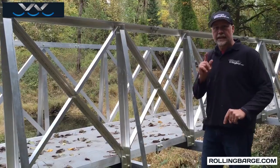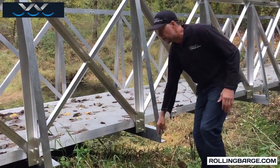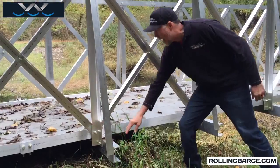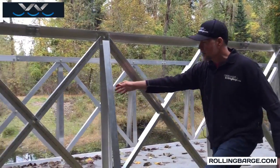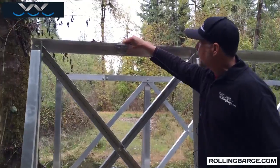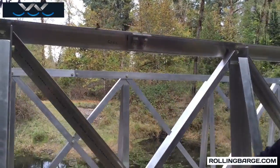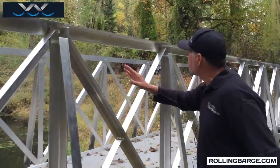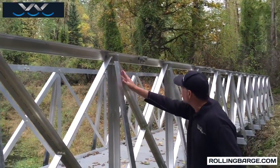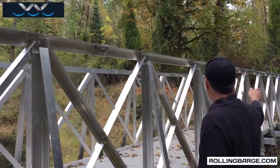The longest piece in this bridge is 8 foot 4 inches long, and that's actually these transverse members that you see right here. The top of the bridge will give you an idea of how this works. You'll see here we have a connection between the top rail, made right here, with the same connection at the bottom as well. If you follow this bridge down, you'll see that those connections are about 8 feet apart. That's how we get away with the 8 foot long pieces.